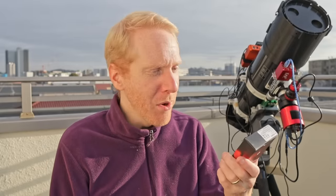And so here we go. We've measured the filter and it performed as per specs broadly, which is incredible. The bandpasses are good. The bandpasses are well centered. And so we have a dual band narrow band filter with very narrow bandpasses. That's basically the equivalent of the Optolong L-eXtreme for much cheaper. What's not to like? Well, we still have something to check, right?